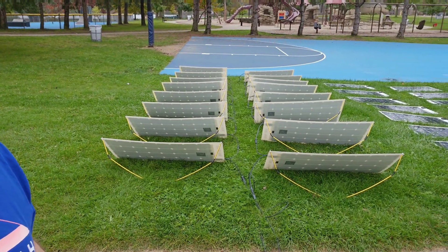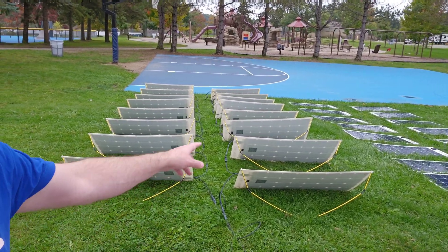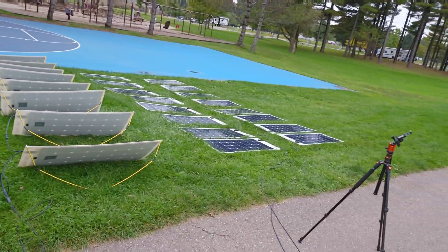I'm going to have to call it quits kind of early today. I got it kind of set up — one string is laying flat, one is up on the stands. This is just two of four strings; I should have two more over there. It is so cloudy I'm not getting anything. But I was able to check out all the circuits — I plugged it into all the connections on the inverter and everything worked out. The polarity is correct on everything, so I should be good to go once the sun comes out. It looks like it's going to rain, so that's why I might kill this earlier today.